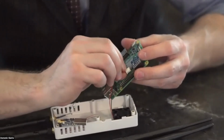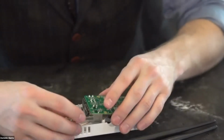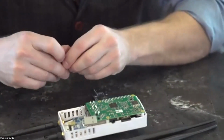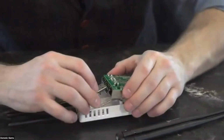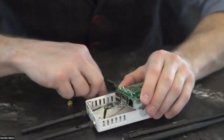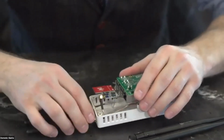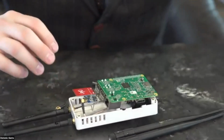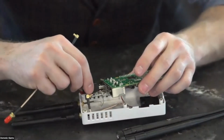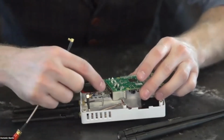So I'll plug my fan into this fan controller like that. And I will also plug in each of my ADS-B antennas here. If you use these ones, they are cut so that you can put them side by side and they will fit. If you use the Nooelec ones, they are just slightly wide and will end up hitting each other, and they'll end up fitting, but you have to really squeeze them together and put them in as almost one piece, but two antennas.